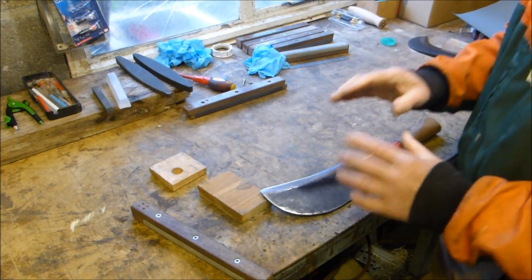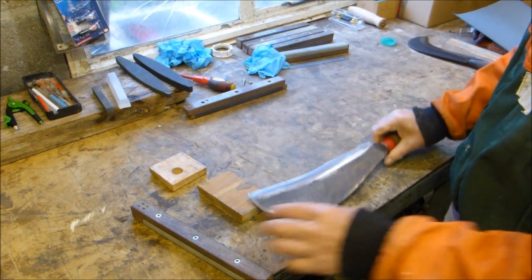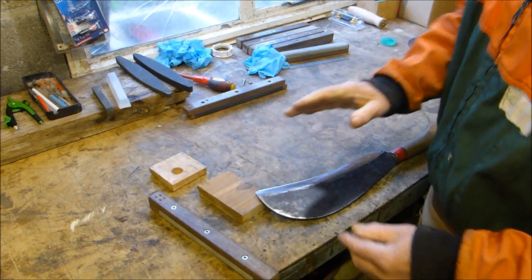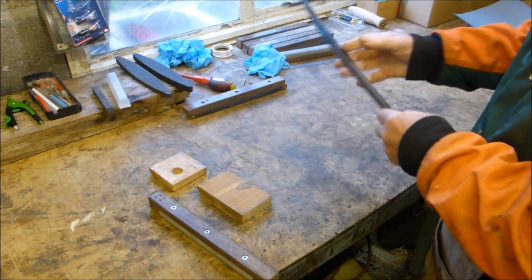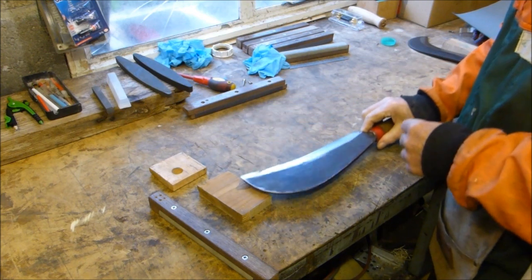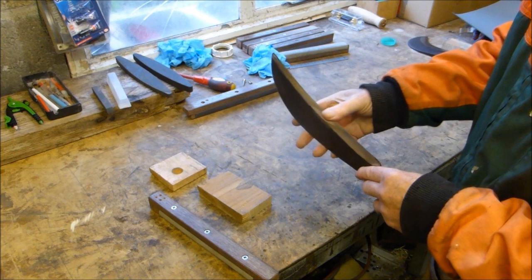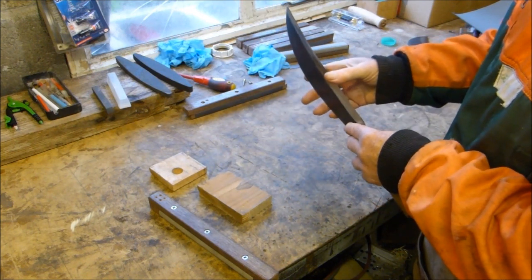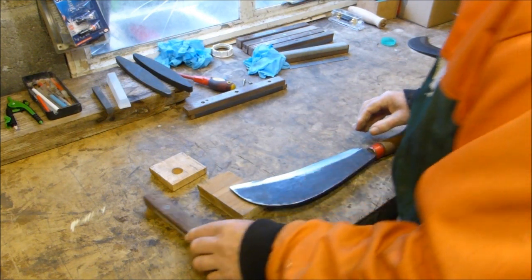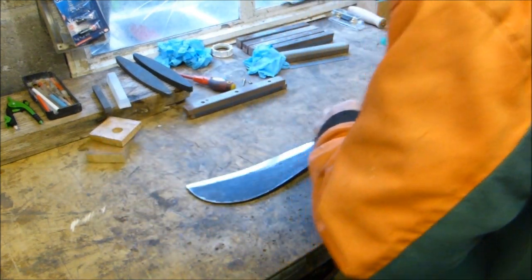But by changing it quite often, you reduce the chance of putting a burr on there, because if you sharpen it one way only, the tendency is to turn the edge. But you want it true, and you will find that when you use a stone after you get to about 1500 grit, you just check it like that by putting your finger across, until it's sharp. But after that, it seems to appear to go blunt, and it isn't. It's getting sharper, and your thumb won't stick to it because it's getting too sharp. So that is the reason for that.